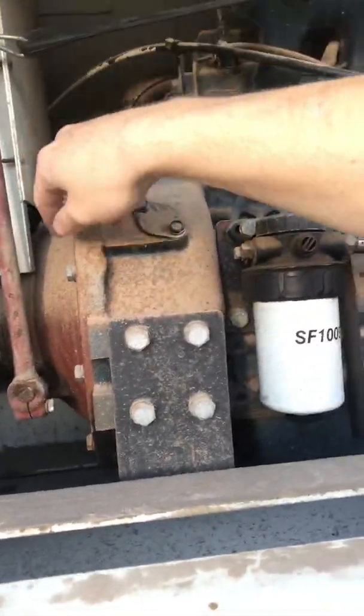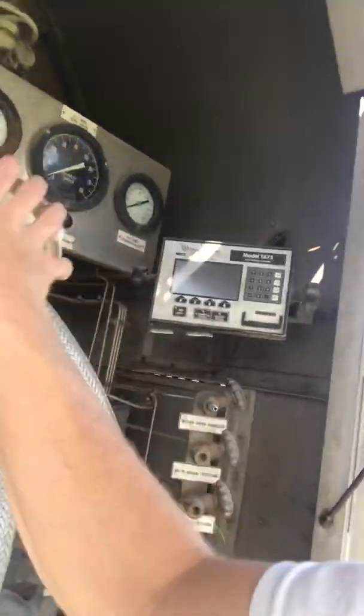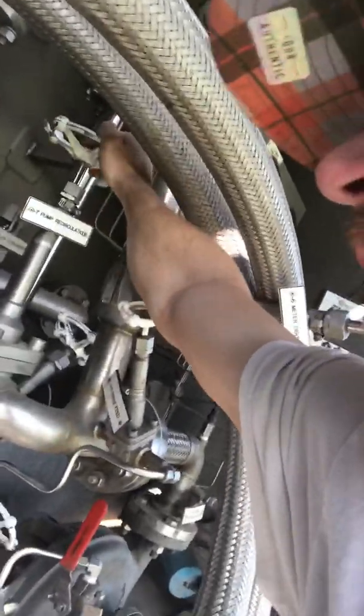You've got your pony motor over here. You'll want a nice bungee or rope, and there's a clutch handle over here you grab to engage the clutch on the back side of this transmission to run your driveline. So once your pump's running, you kick that in and that'll get your pump spinning. Then you come back around, open up your main discharge, shut your pump recirculation, and then you'll be totally pressuring off and unloading.